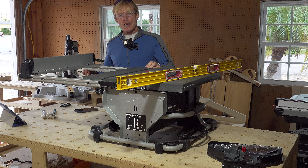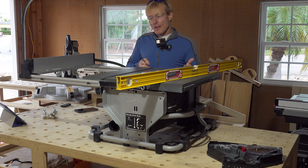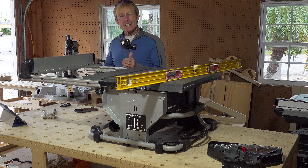Be careful making this adjustment — you can make it so there's very, very little movement, but then it's tight, and the action of setting your fence will become a bit tight. Remember, having a little upward deflection does not impact the quality of the cut, the accuracy of the cut, or the accuracy of the reading. It really has no bearing on anything at all because we've set up the support flush with the table and we're pushing our material down and through. So if it has a little bit of uplift, it's just not anything that's going to interfere with the cut.